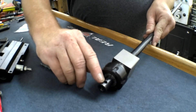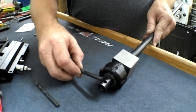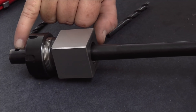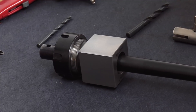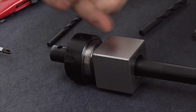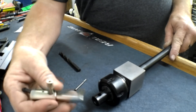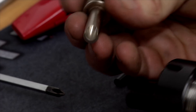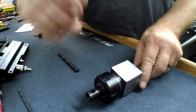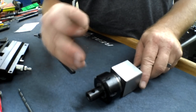The next thing we're going to do is work on the barrel. This is where our transfer port meets up into the barrel, and again we're going to go from a very small hole to a 0.302 hole. You can see the line on the barrel where the transfer port has been rubbing. We're also going to take a small carbide bit — you can use a stone or whatever you want — and radius just the front edge so that as the air comes in it has a nice smooth port. The bolt already has a little cup area for that, scooping air toward the bullet, and we're going to help that along. The hole inside will end up kind of egg-shaped, longer toward the front.